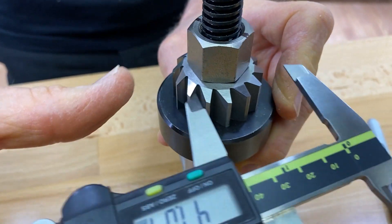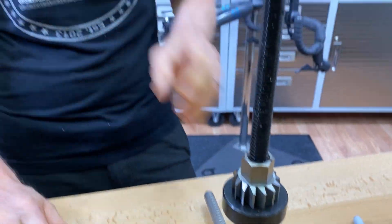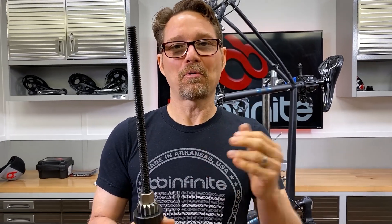You're seeing that this ream had some variability. It's basically 40.98 — there are two tines on here that are 40.98, I've already measured it all out. But a lot of them are slightly under that. Whether that was intentional or not, who cares? The finish will be 40.98. Now we feel secure that we can actually use this to create the proper hole diameter so that anything we put in there is going to be magnifique.